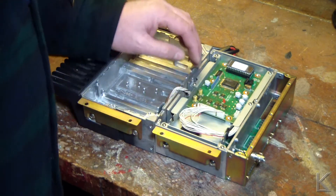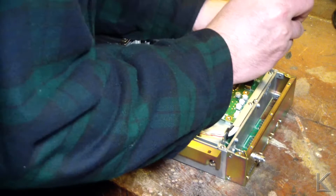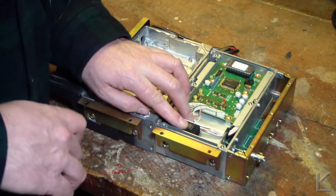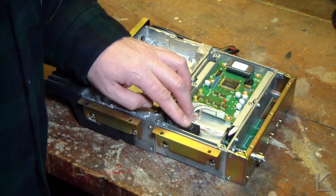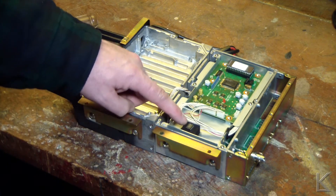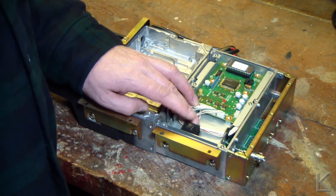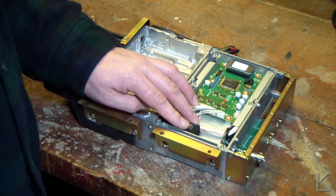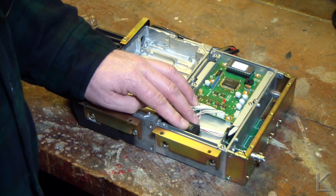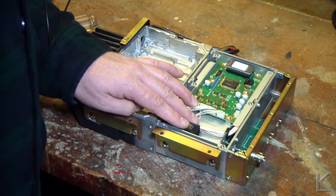We've got some control cables here, and underneath this little panel is the receiver board. This little chip stored in foam over here would go there — this is the PL encoder. So this repeater is operating without PL tones right now. I think they pulled it because it needs to be programmed with PL tone sets for amateur use, since we use different tone segments than commercial repeaters.